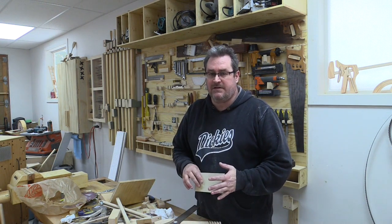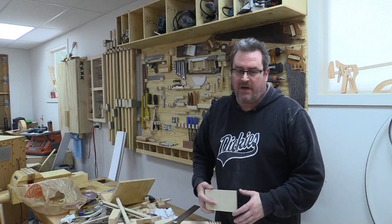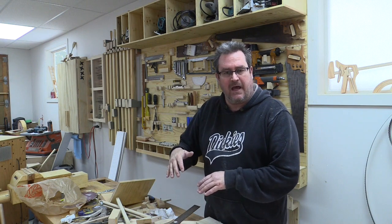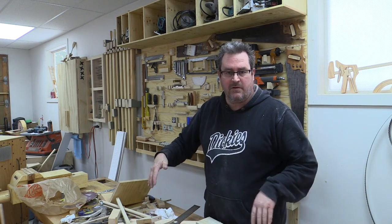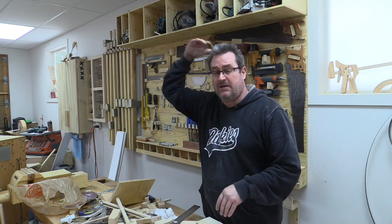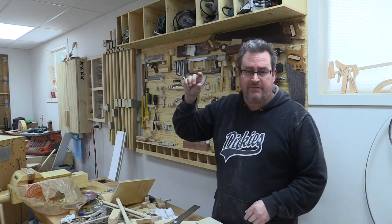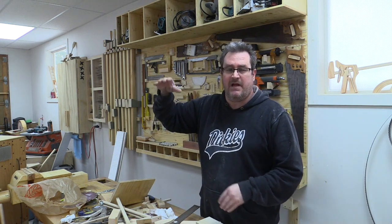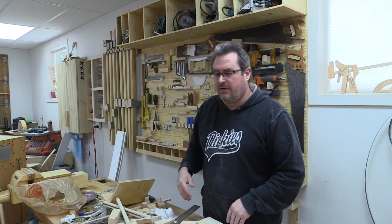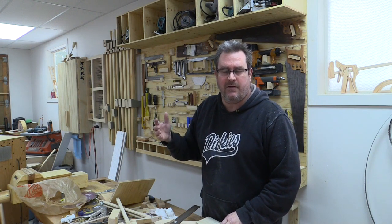The total was just a little over $1,000 to get everything done. The things that I had before I started was half the insulation for the ceiling. The R20 batts that I have — what I wound up doing was ripping those in half so that I actually have R10 to R12 above the entire ceiling now. And above that, there's a layer of one-inch foam which is R4. And above that, there's another layer of R12 batt insulation up in the joist space, for a total of around R30 to R31.